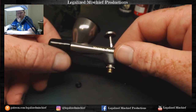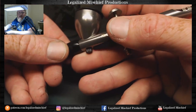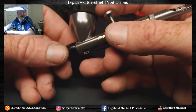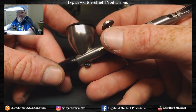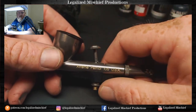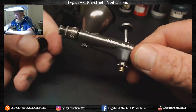It's a really good detail brush. I like that I can adjust the pressure under the cup with this dial here - if you release it out you get more pressure, screw it in you get less pressure. So as I'm painting I can adjust based on the viscosity of the paint without having to touch the compressor. I just set the compressor and forget it, adjust pressure here, and just spray.